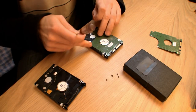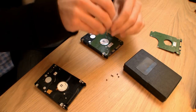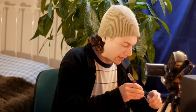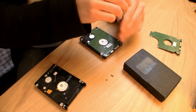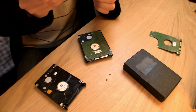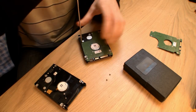One very important thing you must make sure is that your screwdriver isn't magnetized, because obviously, being a hard drive using magnetic storage, it's not a good idea to have any magnets near your hard drive. So do demagnetize your screwdriver if it's magnetized before you take the screws out, or even before it gets anywhere near your hard drive.